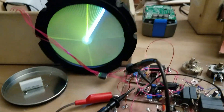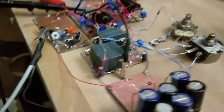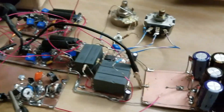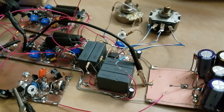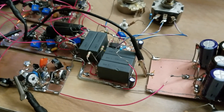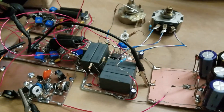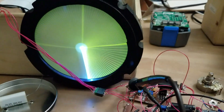This is pretty much the whole thing right here. This circuit has about a 1 Hz oscillator, and then it has a phase shift network to create a 1 Hz sine wave and a sine wave that is 90 degrees out of phase with the original one. Then it modulates a 1 kHz sawtooth wave with those signals to create this XY pattern.